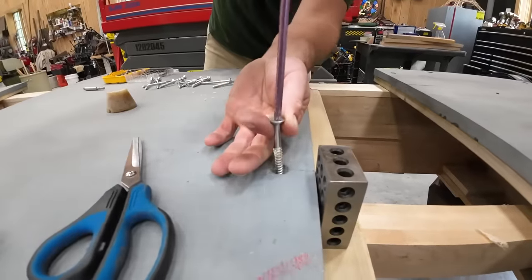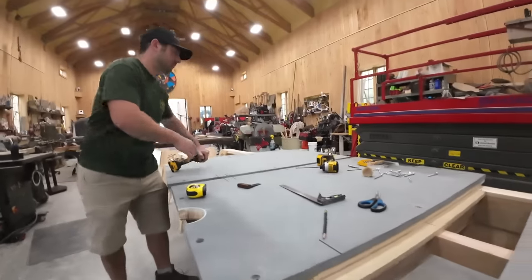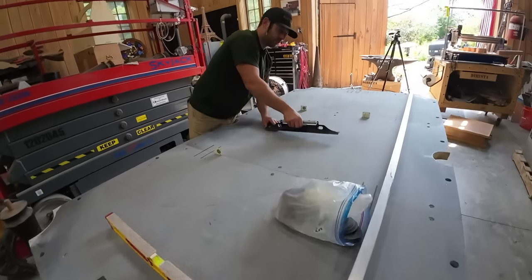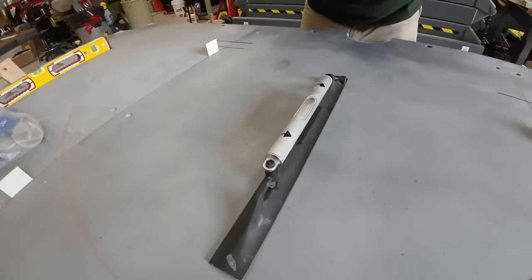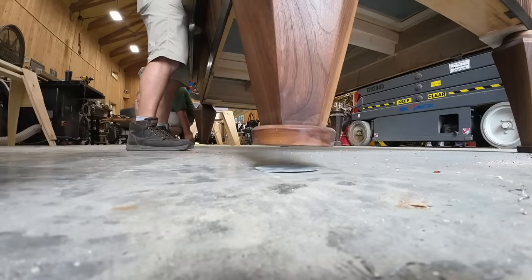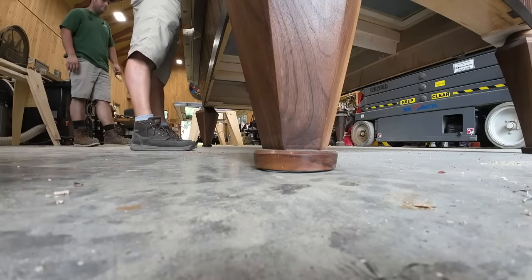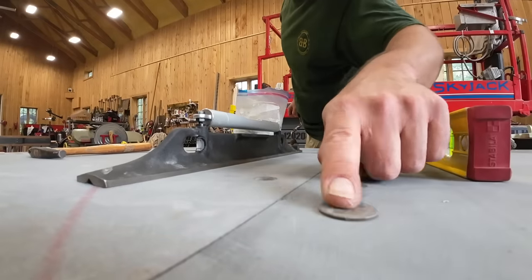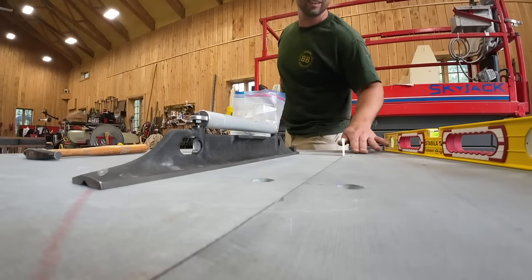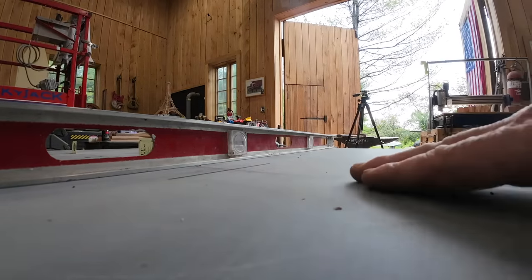Now Jeff finally shows up at the end of 10 months to put the table together in a professional manner — and I'm learning from him in this circumstance, I am his apprentice. Jeff brought out this crazy Starrett level — it is super accurate. Simply by changing one or two of those pads the bubble goes way off or way on, and he said it's his prize piece that he brings to every installation to make sure everything is level. He uses a quarter and slides it past the seam — if you don't hear the click, you're flat, everything is perfect, no more shims needed.